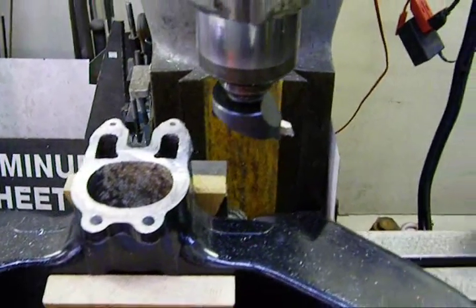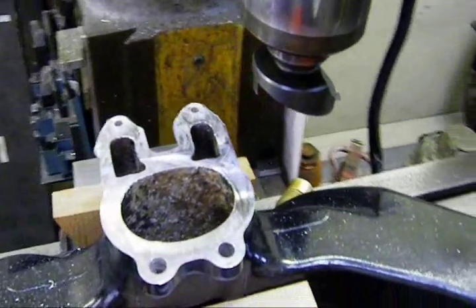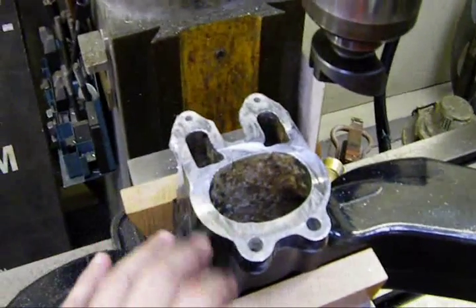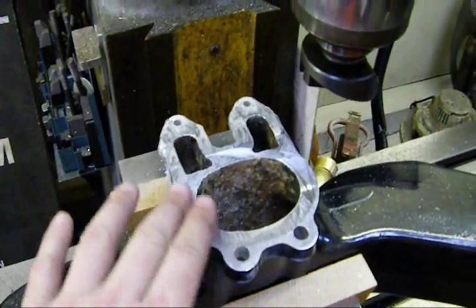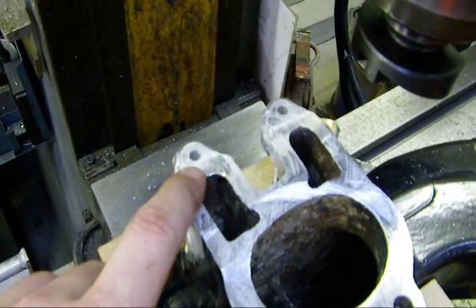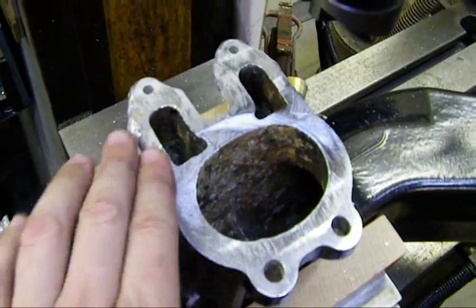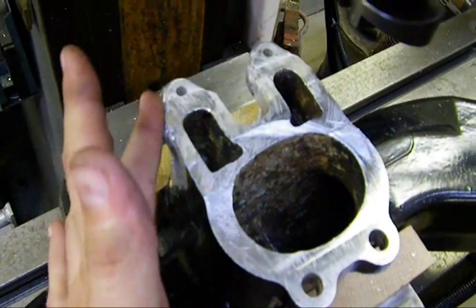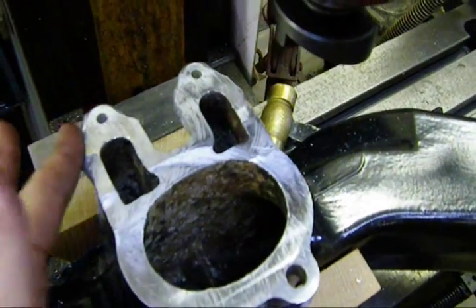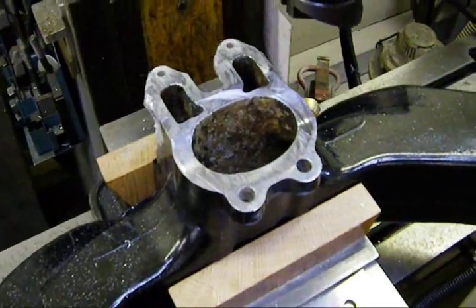I didn't take a video of me fly cutting this thing because it took me a while to set up on the indicator — it must have warped a little bit. I had to take about 5 thousandths off more than the rest of the whole piece, which isn't that much. It's pretty smooth now. As you can see, there are the pieces I welded in here and here. I'm going to enlarge the holes to match up with the gasket, and I also have to clean up these surfaces all around. All in all, pretty good fix — worked out pretty good.